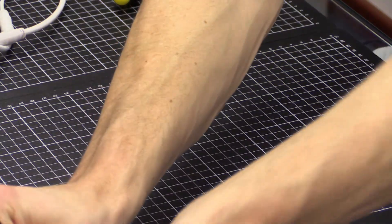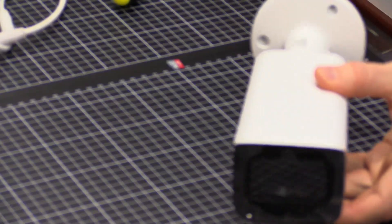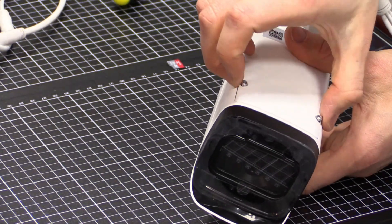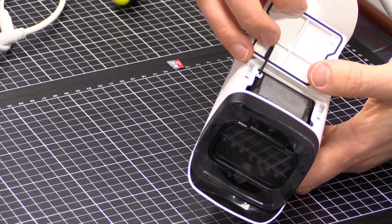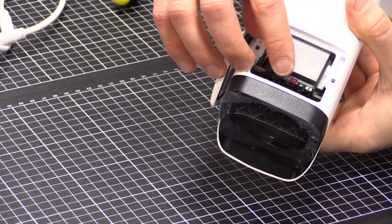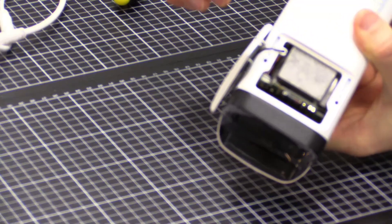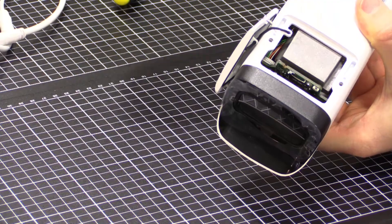This is very similar on many of the other bullet series cameras. Here's a six megapixel bullet camera. This one is a little different on the base — there are two screws which, once loosened, allow a flap to lift off. There's a little rubber piece so you don't lose the flap. Again, you can see the microSD card slot. Look for positive engagement: slide it in, listen for the click, and if it clicks it's in. To release it, simply push and release.